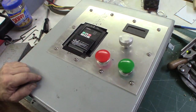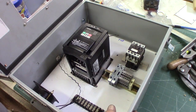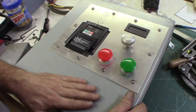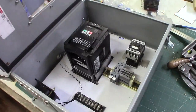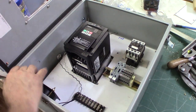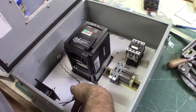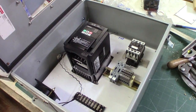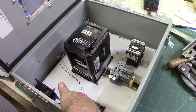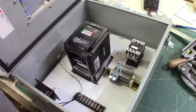That was what I needed the 30-millimeter punch for — I used it for these holes here, and that's about it. This all worked out pretty good. I got the box dirt cheap because of the cutouts that were already in it, off eBay. Now I need to put some more screws in to bolt this panel down, secure the hinge pin all the way in, and start wiring. I have a couple knockouts to do for the power cable coming in and the motor cable going out.